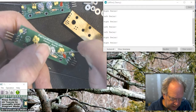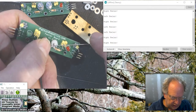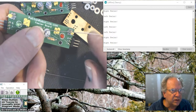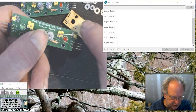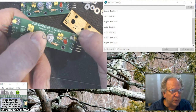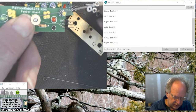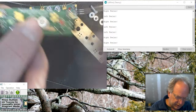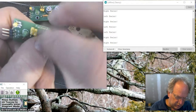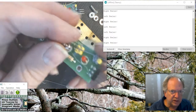Then you want to have it so that the loop, see what actually happens if I have it out here, it goes way out to the front. If I have it like this, it brings it in pretty darn close, and I can easily adjust that with a gentle bend. So hook it this direction. Okay, so my open end is down. I'm going to do just one of these, and then we're going to run out of video time. And I'm going to put a washer on and a nut. And like so.